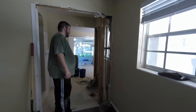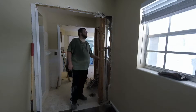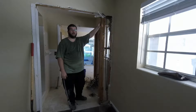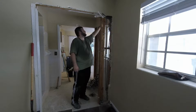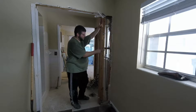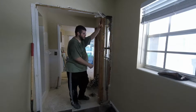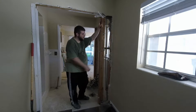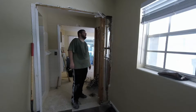The next thing I'm going to do while I'm waiting for her to arrive is tear out this last segment of tile here, then cut across the top with my jigsaw along the line I have drawn on the inside of the drywall, all the way around, and then take out all the nails. Yes, nails — because back in the 60s they used nails instead of screws. I can't imagine being in Florida heat putting up drywall with nails instead of a screw gun or a nail gun.